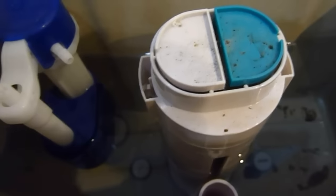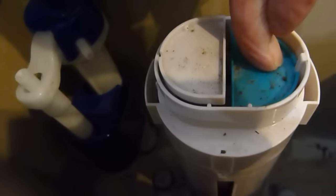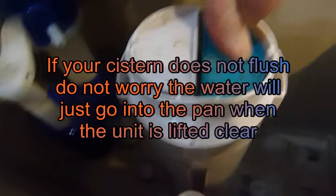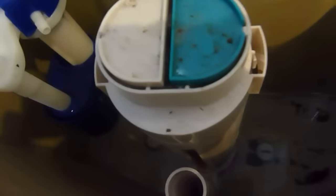Don't worry, don't fret it. It looks bolted through, and at first I thought it's bolted — so you can see the bolts through the bottom — it's all got to come out. But no, it still doesn't have to. I will show you now. We turn the valve off there — she's off — and we'll flush the system. Flush her out. Put your finger on the button, let it go right to the bottom. The reason why this particular system is different is because it doesn't have a pull switch down there — there are no levers to pull it off. What you have to do is just twist it, and once you get it in the right direction — it's usually about there — it lifts away.